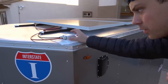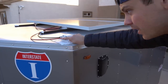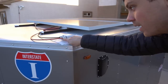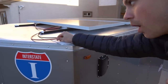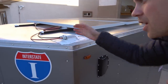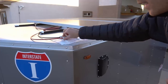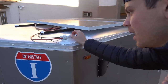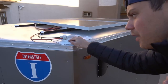Some viewers said this was mounted the wrong way — that is absolutely false. You can have this mounted any way that you please. If these did not seal out rain from headwinds while driving, I would not use them. These grommets can handle a hurricane. When I mount these, I like to put them in the most readily accessible area so I can swap out conductors or add more solar panels easily. I've seen other people mount these in the middle of the roof, which seems very illogical. I want it at the edge and front so it's easy to access and check if connections are tight. I've mounted these on every vehicle I've lived in, minus the minivan.